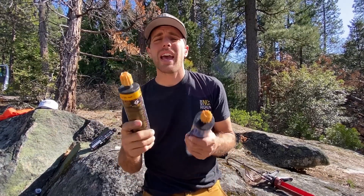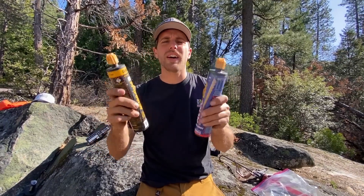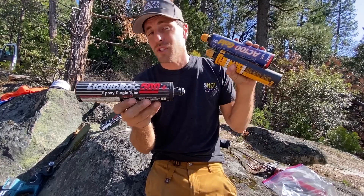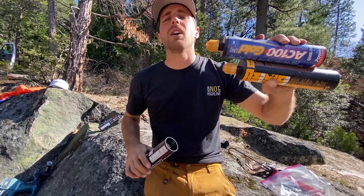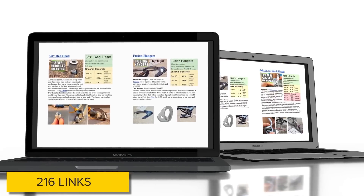There have been a handful of tests where we used expired epoxy — this is vinyl ester, which is not as good as epoxy — and the bolts were still breaking. Quite a few of our tests are done with expired epoxy because it was working just fine. Polyester is substandard compared to epoxy, and vinyl ester is kind of in between. I'm going to mention Bobby and my favorite epoxy so far — it fits in a caulk tube and is roughly $20, about the same as these. It's a good epoxy, though if you're wearing a big jacket it won't come out in the cold, whereas these can be used in cold weather with quick drying time. Pros and cons with every type of glue — you can go to the Bolting Bible and check all that out on slackline.com.